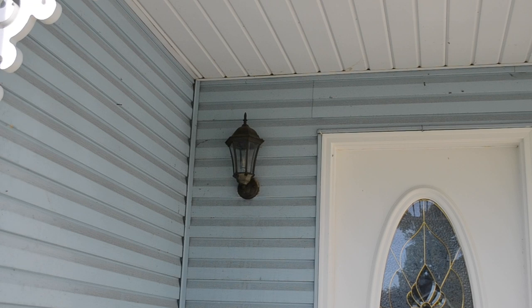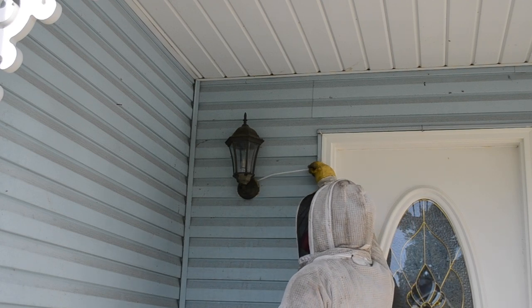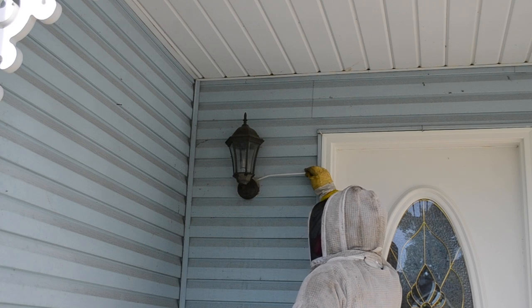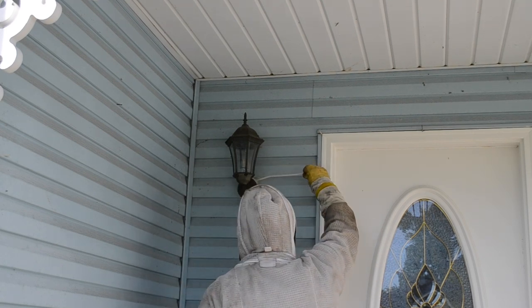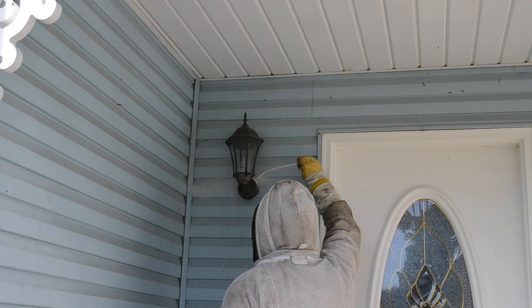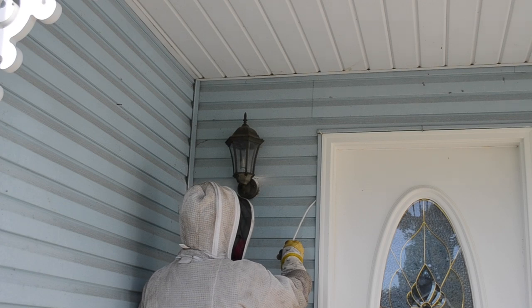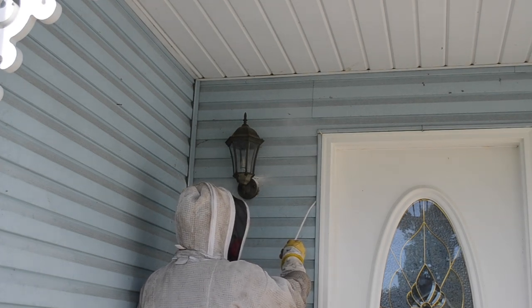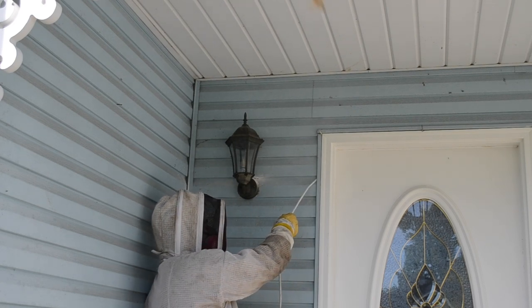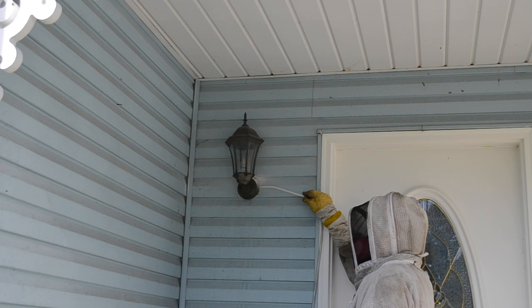You may be asking yourselves: when is it appropriate to use the infrared and drill on the inside? Typically it's later in the season and when you're getting yellow jackets into the living space. These will eat through drywall if you let them go long enough. If the nest is big enough to see on the infrared, they're going to be working on that drywall pretty quickly. This technique is really for jobs where they haven't eaten through yet but may be close to a furnace register or an outlet that's letting them get inside the living area.